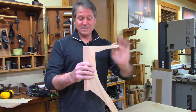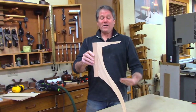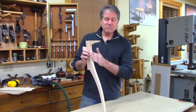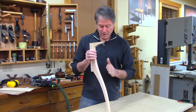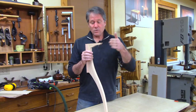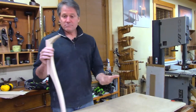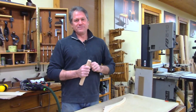This little cleat comes out and has a solid joint there too. Now we're seeing the actual profile we drew — but how's it going to look in three dimensions? One last thing: I always like to slightly radius these outside surfaces. A flat square surface doesn't have warmth. By giving a slight radius to this outside surface it will conform nicely with the rounded edge of the top, and it will be a much warmer, more inviting piece. I'll show you how that goes.